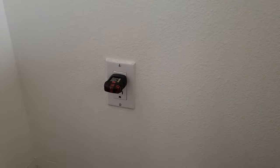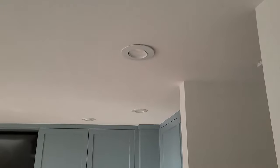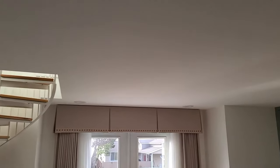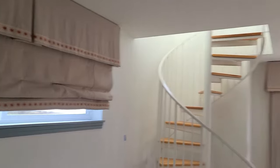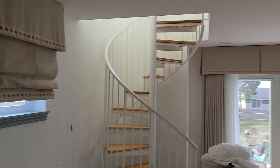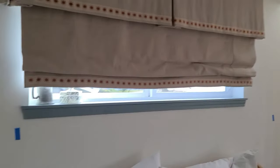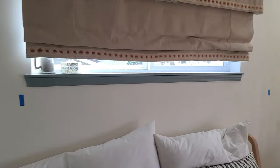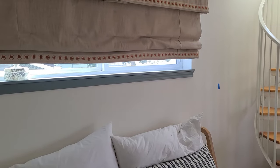There it is — no more power. So Lindsay's back from turning off the power. I noticed that these lights turned off when she turned the power off too, so the wall outlets and the recessed lighting are on the same circuit. It looks like there's five, six, seven lights in this room and two, maybe four outlets. It shouldn't be a big issue — those recessed lights are all LEDs and these are going to be low voltage LED as well, so no power draw. But normally 10 to 12 fixtures at most on a circuit before you start overloading it.